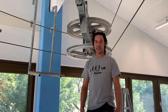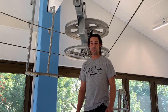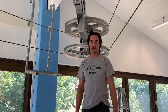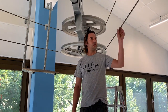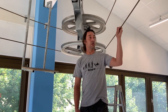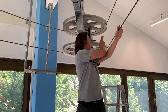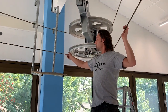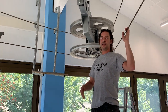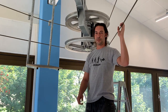Always watch out for your own safety. When you're doing this, make sure the emergency stop is pressed everywhere and you take off the main fuse of the electric cabinet. And then also, just to be sure, don't go on the ingoing cable — this is the danger zone; when your neck goes in between here and here, it hurts. Always go to the outgoing cable — you can sit here, you can do it there, it's much safer. But remember to press the emergency stop. Always stay safe and take out the main fuse.